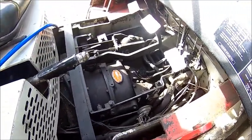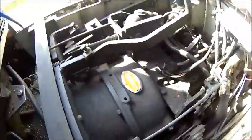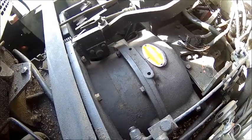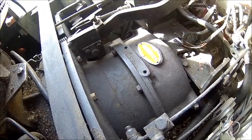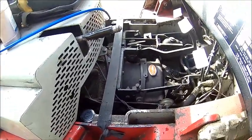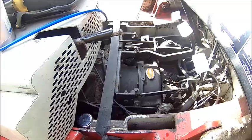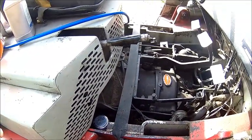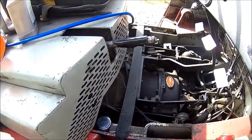We still need to dress the brakes, and the throttle stop needs to be addressed as well, because the stop is on the engine, so it shouldn't be that far. Someone turned that out because it wasn't running, because it was only running on three cylinders or whatever. Next thing we're going to do is valve clearance. I think we do that now, because he's going to ring me in an hour or so. Let's have a look and do the valve clearance.